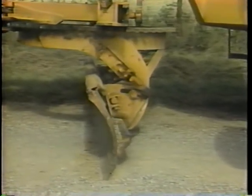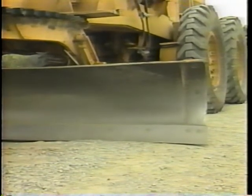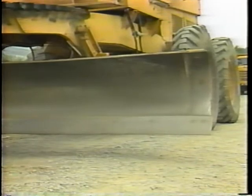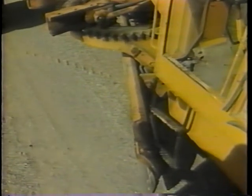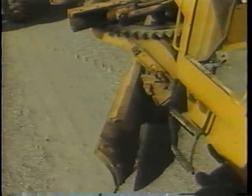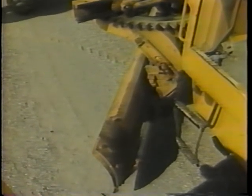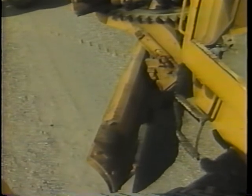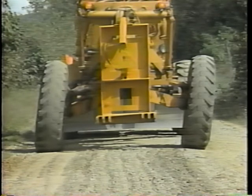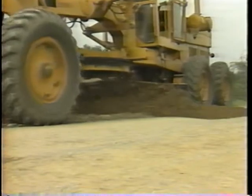The bottom edge of the blade must be in front of the top edge. To obtain the proper cross slope, which is generally 4%, position the blade so the end near the center line is slightly higher than the other end. Next, angle the blade between 30 and 45 degrees to the motor grader's axle to form the windrow toward the center line of the road. Then shift the blade to place the windrow inside or outside of the wheels. Lean the wheels in the direction of the windrow to help counter side thrust on the blade. Make a windrow, and do not run the motor grader's wheels over it.